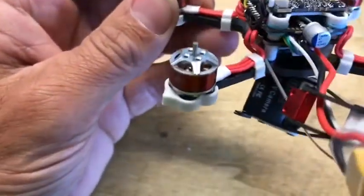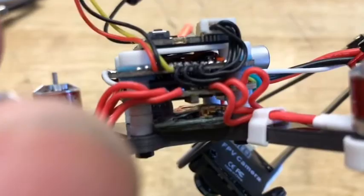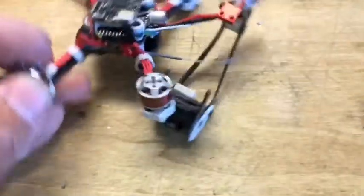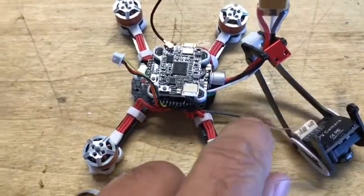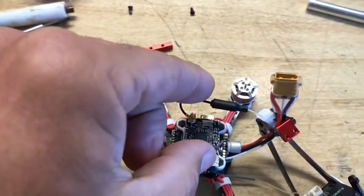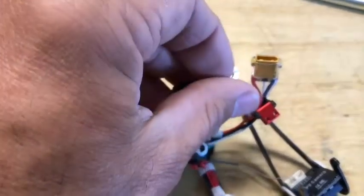That'll be away from the props because the antenna on these just turn and pivot. You can see it right there, a little gold thing on the bottom. Anyway, it turns and pivots and will be sticking out the back. Should be completely clean, and I wanted it on this side because I've got my video transmitter that's going to be running on the opposite side, and try to keep this a little cleaner from the signal.